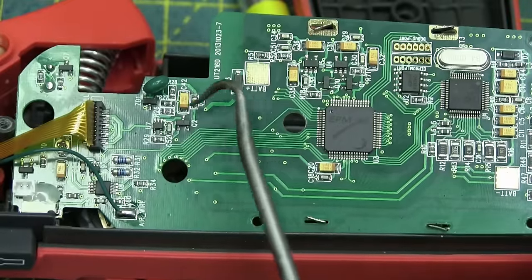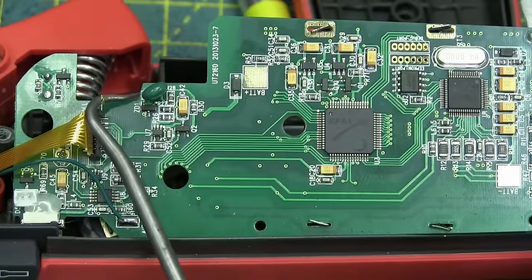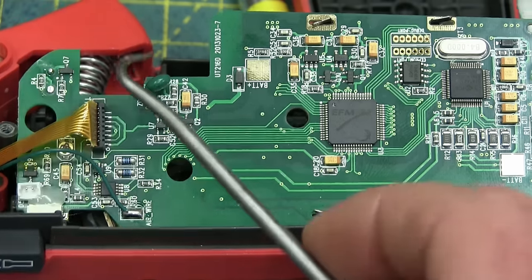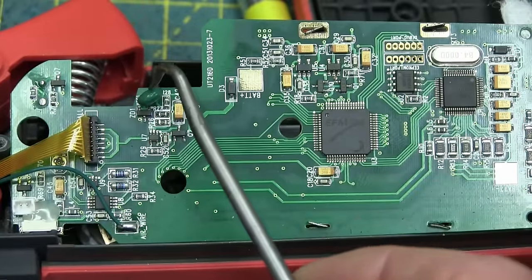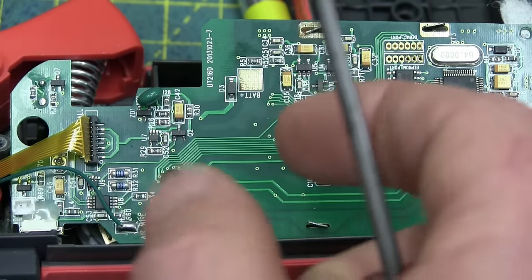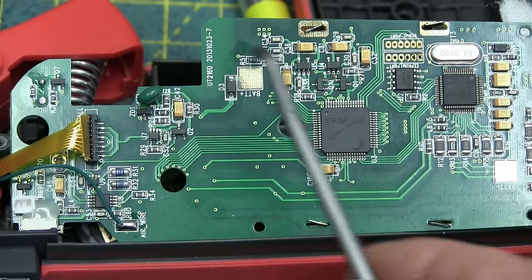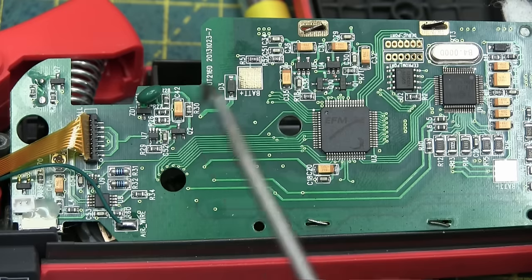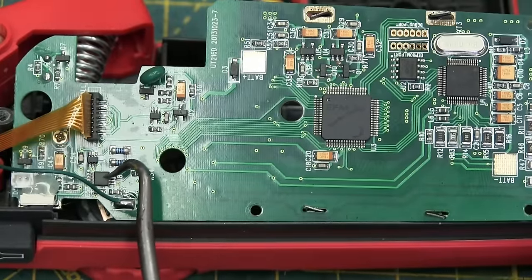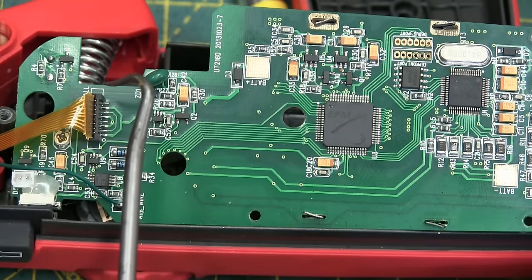Further on down the line we have the other battery tab, tantalum capacitor, some active components — MOSFETs. This is marked on the PCB as NTC — a negative temperature coefficient thermistor. It's a sintered ceramic/metallic material, and what it does is change its resistance a lot depending on a small change in temperature. So this must be some sort of compensation device so the instrument knows what temperature the board is at and can compensate from there. Down here looks to be a little op amp — a Texas Instruments device, 5053Z333. And here's the input for the Hall Effect sensor.